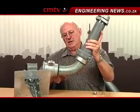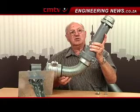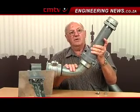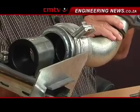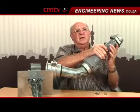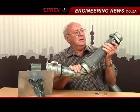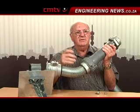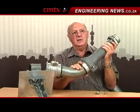The spring is normally in the vicinity of about 1.2 metres long to accommodate the curve of the cable. Where we come out and the switchgear is at a higher level, we do have extension pieces that we can build on here to reach up to the required switchgear. In many cases we come out and have to go up against a pole which goes up three metres, or a mast which goes even higher. We have extension pieces that build up right to the top to the required length.